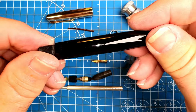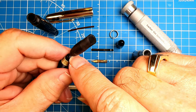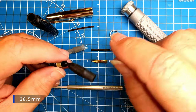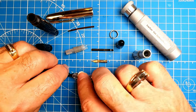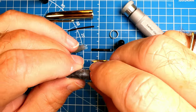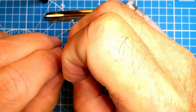I've got all my parts cleaned up — the barrel is perfect, as is the end cap. I installed the sack inside the cup and was smart enough to Dremel it out just a tad to give it room for the new one. I've trimmed the sack to 28.5 millimeters and we're going to put it back together. Apply a little bit of talc. I'm using my pellet pusher from the Pendragon because it fits neatly inside the diameter of that sack — we're going to push it back on itself, which sometimes takes a bit of teasing.